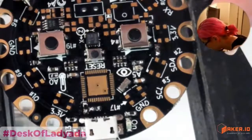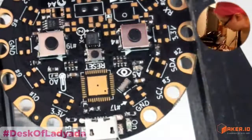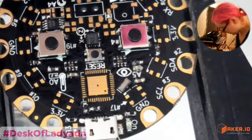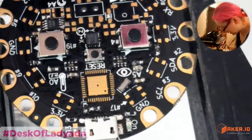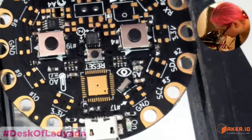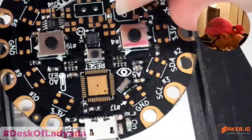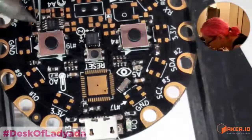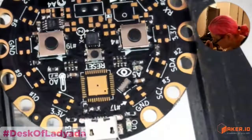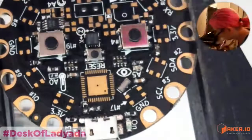Yay! All right, so now I'm doing the resistor divider for the microphone. The microphone, initially I was hoping I would be able to just read the voltage right out of it, but it's actually pretty low voltage. It's only like a couple millivolts, and so I need to stick an amplifier on there. Again, I was thinking if eventually I upgrade to something like the SAMD series, it has a differential amplifier, and so I might have been able to amplify the voltage without needing an op amp and all of these passives, but for now this is what I got.